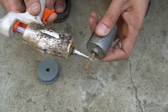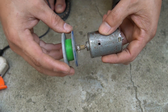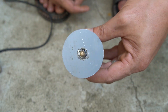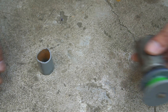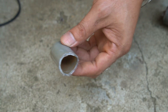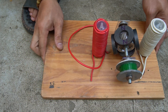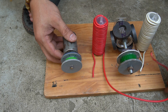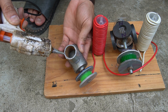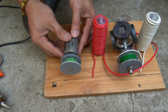Then I used one small motor and one other pulley. Then used special glue to attach the pulley to the small motor shaft. I will add one more leg to the motor to make the motor higher. Then I used specialized glue to fix the motor to the wooden base.